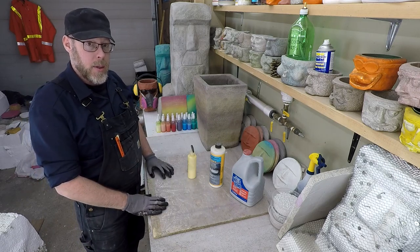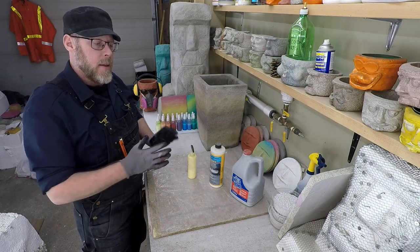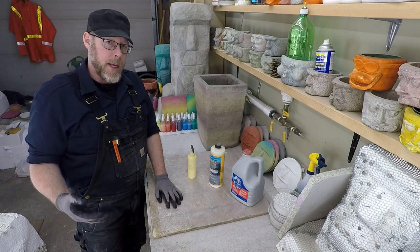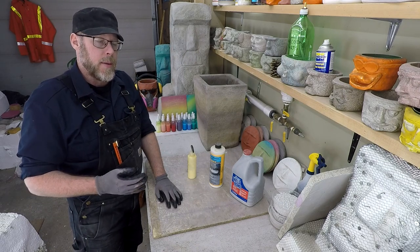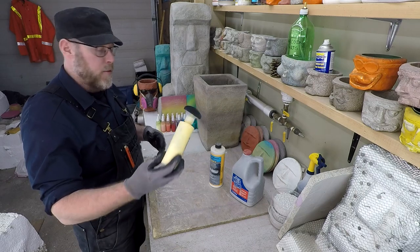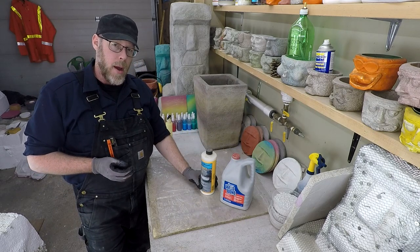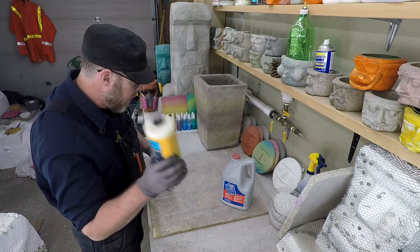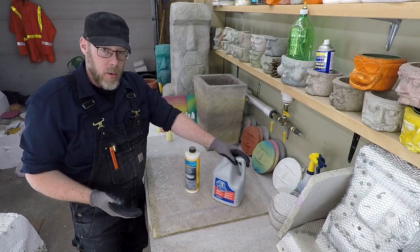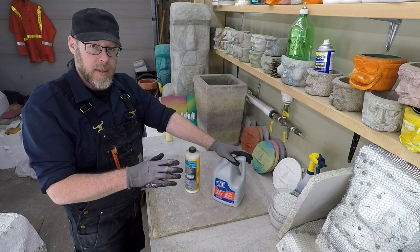So how much glue can you add to a concrete mix? Typically speaking, when I'm mixing concrete, I would take 10 to 25 percent of the water I'm going to use in the mix and replace that with a liquid glue or liquid PVA product. PVA is polyvinyl acetate. When you're adding glue to concrete, you're not typically reaching for a carpenter's glue — you'd want to go to the concrete-working aisle and pick up one of these PVA-based products. You can tell it's a PVA-based product because of how thick it is — this one's super thick.